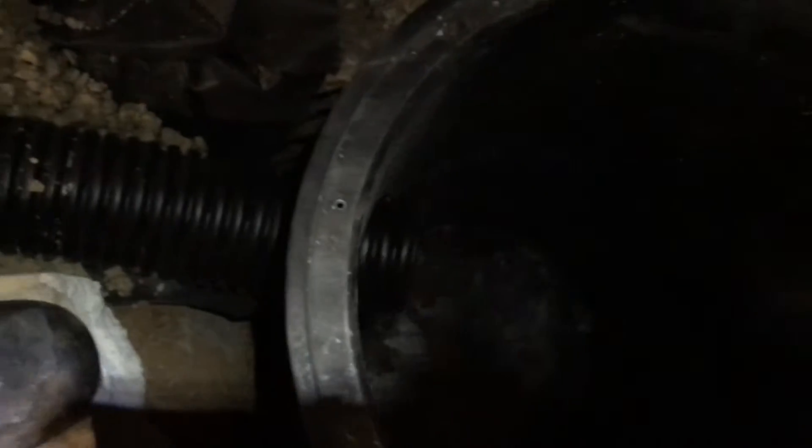We've got one side up with just the plastic, and you can see where it meets in the back. We'll put another piece on and go around with the dimple board. We set the drain tile in — you can't see it, but it's perforated with little holes in it — and we're going to connect it right to the sump tank.